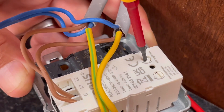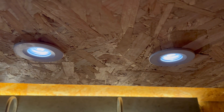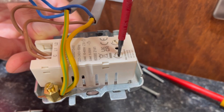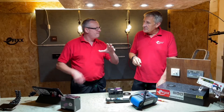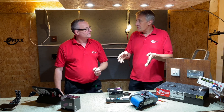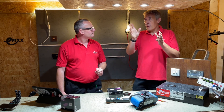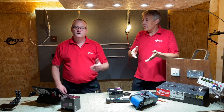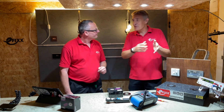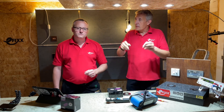Just as you're used to trimming the low end — setting that smooth lower dimming point — you can also reduce the power output down to about 60% of its full power. So you get an automatic 40% saving on full brightness, and you still get great dimming performance, but you've just limited the maximum power output. That also has two other great effects: running LEDs at lower power improves long-term reliability, and also improves lumen maintenance over time — the lower the power they run at, the less light you lose over tens of thousands of hours.